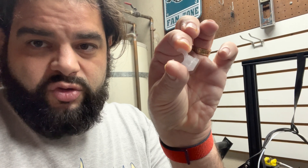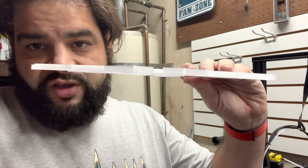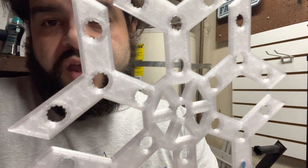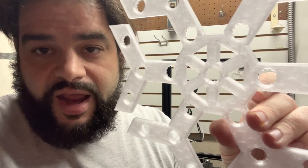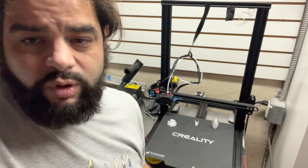We have a little clip - part of a larger mounting system. We're going to see how well these hold on to the nodes and whether they'll snap over time. And our 25-pixel snowflake: about four to four-and-a-half hours to print on a CR10, five millimeters thick, only about 15% infill so you can see the large honeycomb shapes. This design uses little ridges to hold the pixels. I'm not sure whether it looks better from the front or the back - it's a different design than I've seen before. Printed in transparent PETG.